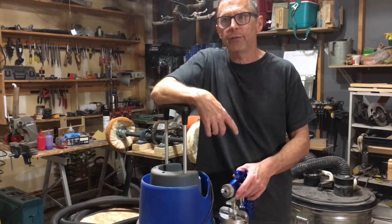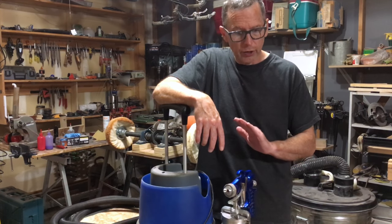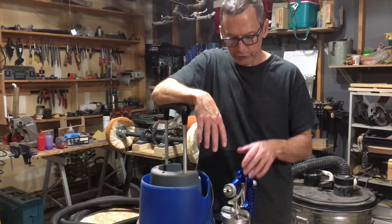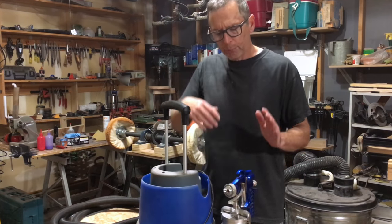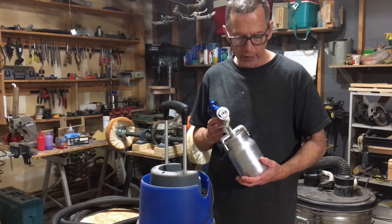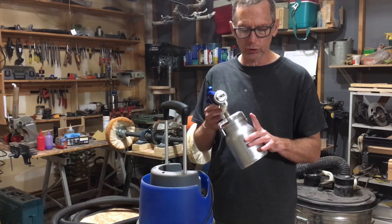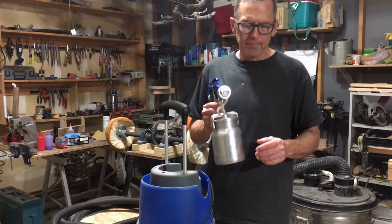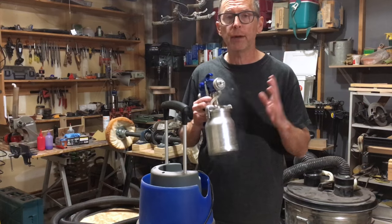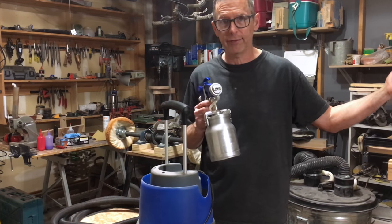After two to three years of using this sprayer I'm pretty happy with how it performs. It lays down clear coats beautifully — very smooth — so I don't have to do as much level sanding and polishing once the clear coats have cured. The only problem is when it comes to painting guitars, I don't think this is necessarily the best choice. The fluid canister is just too big; it holds a quart, and because it's a siphon feed, I'd never fill a full quart just to paint a single guitar body.